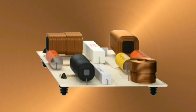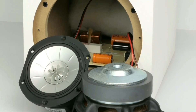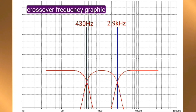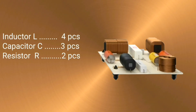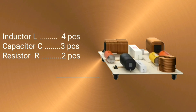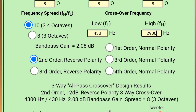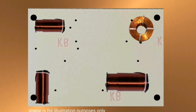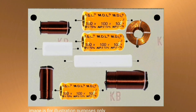At the base inside the cabinet is a crossover. This is a 3-way crossover with crossover frequencies of 430 Hz and 2.9 kHz, consisting of several components: 4 inductors, 3 or 4 capacitors, and 2 resistors. This appears to be a second-order reverse-polarity crossover design. Here is a schematic online that may help visualize this — does it match what is actually inside?